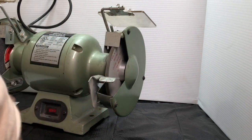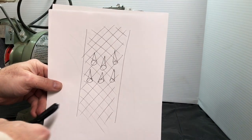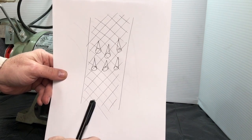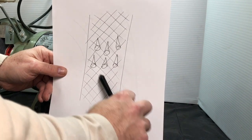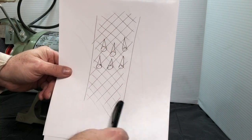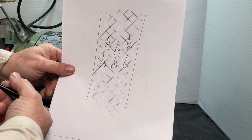You don't want to go too deep — let me explain why. So this is our wheel, and with our stick going in on a slight angle in both directions, when we first put the wheel on the whole wheel is 100% bond. What we want to do is use this soft stick to wear away the bond and expose the grits. We want to go in an angular pattern so that we leave the back of the grit with bond supporting the actual grit. If we go too much and go crazy with the dressing stick, we'll remove all of the bond and the grits will just fall out, prematurely wearing the wheel down — and we don't want that.